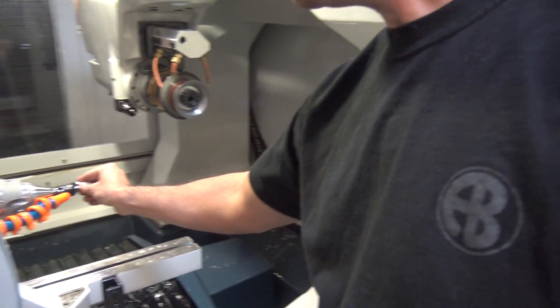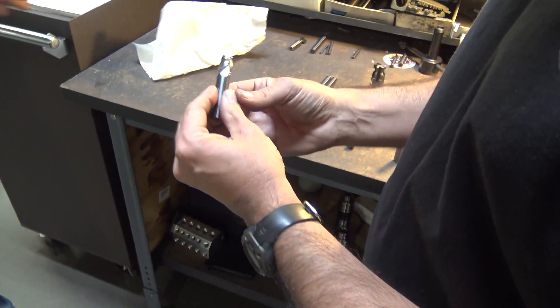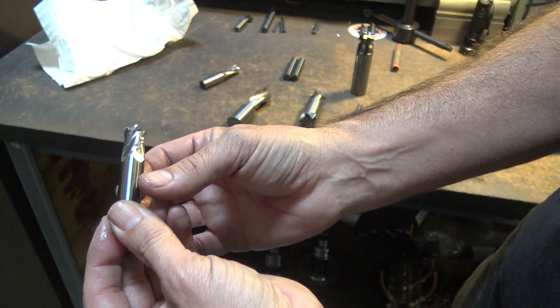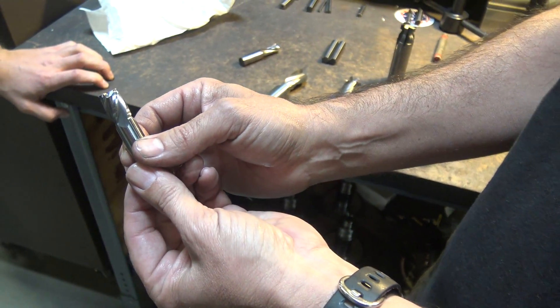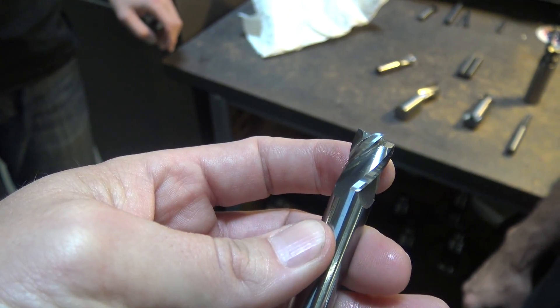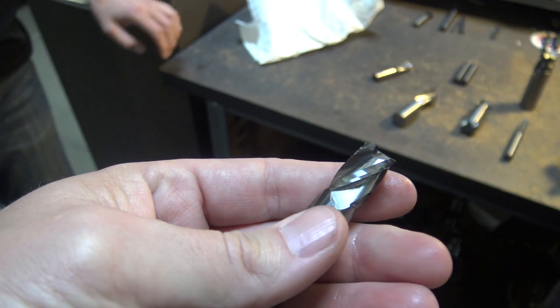This machine is our one. We're pulling off a finished end mill that we can stick right in a machine. It took a little over eight minutes. You can see the radius gashing — it goes along the radius just slightly. How many grinding wheels for this tool? Three. But for a lot of our jobs I'll use every single pack and every single wheel in there. That's amazing.